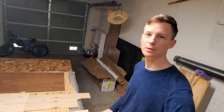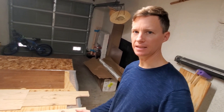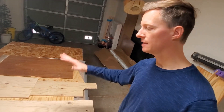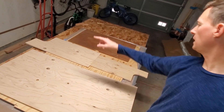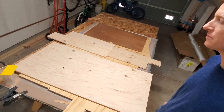Well, my camera ran out of storage before I could finish that time-lapse. But all you missed was — on the second side I finished the fiber-glassing. I put on peel ply, then covered it in plastic, and put a large piece of plywood over it and a couple more just to add some weight and press that down smooth.